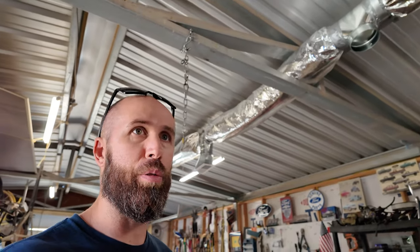Shazam! And I'm back. So, it is as I had feared. The barrel fan in the swamp cooler requires unrestricted forward flow of air. It doesn't create any pressure at all, so I'm neck down too much and just creating back pressure, and the air is swirling inside the barrel and not going anywhere else. Oh, see, now he gets it.